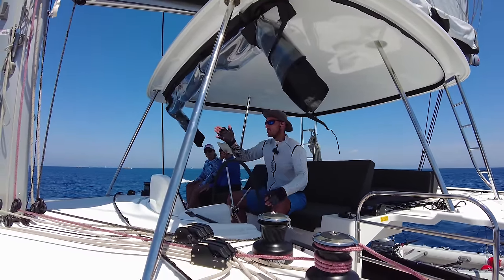So this is the line in the back, and you can see it's very long. It's mostly because there is no other space to tie the boat to. But having long lines is very important when you have a lot of waves, because then the ropes stretch more. If in this case we had a cleat here and a very short rope, and did the same in front, then the rope wouldn't stretch and it would cause very high forces on the boat, and it wouldn't be efficient in holding it forward.